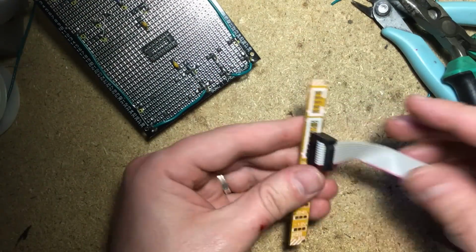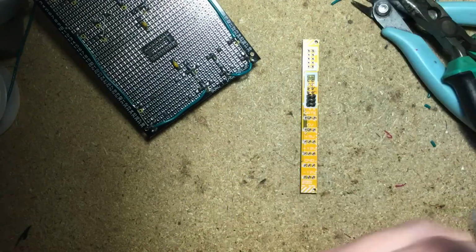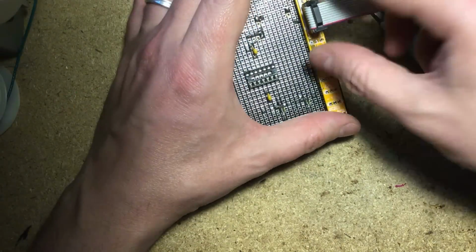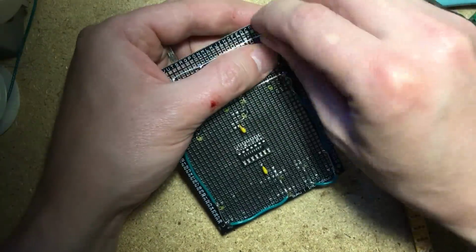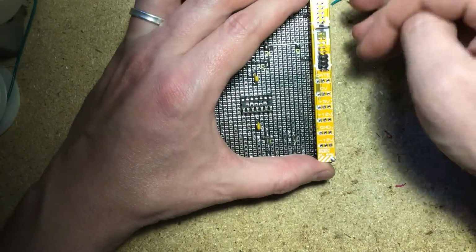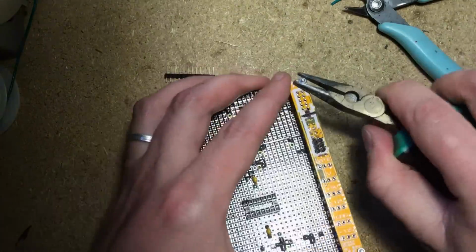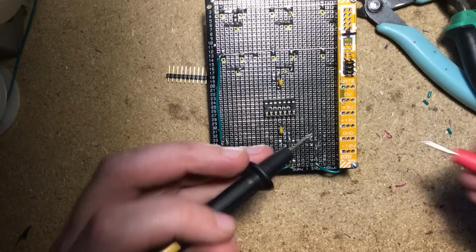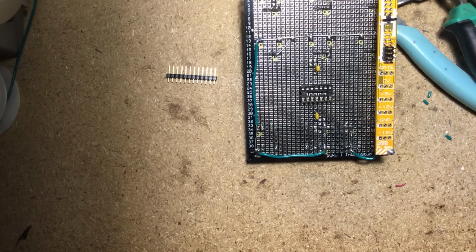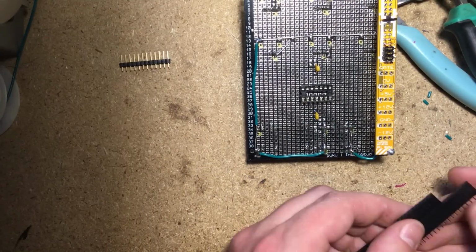While assembling the power conditioning PCB, I screwed up and soldered the power header on backwards. So I had to remove it and replace it with a bare connector. Make sure you install the header correctly. This little PCB is not necessary, but it's a good idea for prototyping because it protects your system from any mistakes you may have made, such as shorts or inverted power connections. It mounts onto the rest of the module quite nicely with the included spacers.